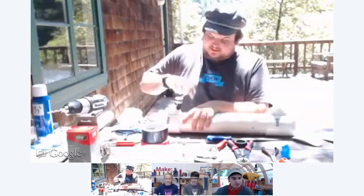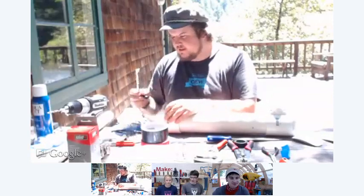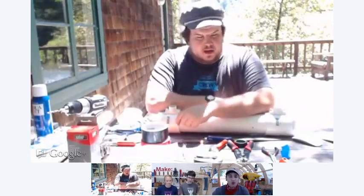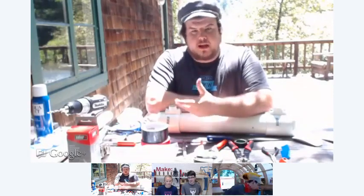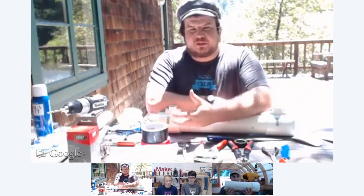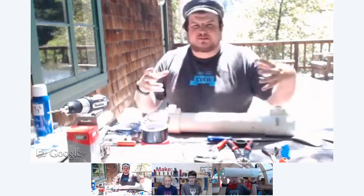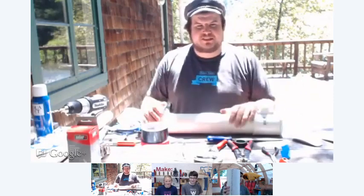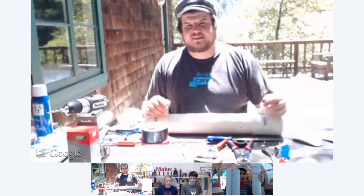Dan, we have another question. What do you recommend as a good length for a combustion chamber of the cannon? My favorite dimension is 4-inch, schedule 40, by 2 feet. It's large, but it's not too awkward, and it gives you a really good volume, and you get a lot of power out of it. I've seen some guys using 6-inch PVC, and it just gets too big. It's too awkward. So my favorite dimension is 4-inch PVC that's 24 inches, or 2 feet, long. So you can see the difference.